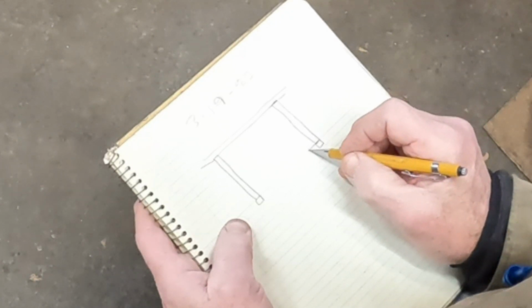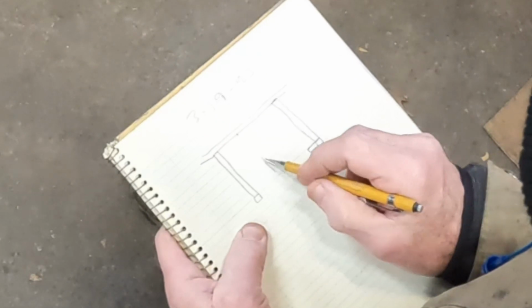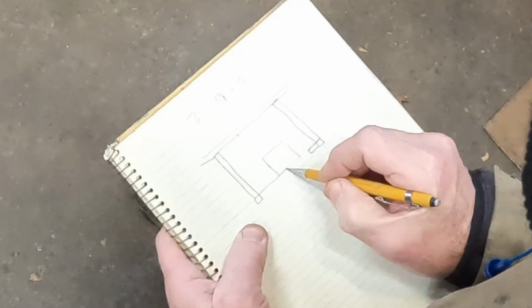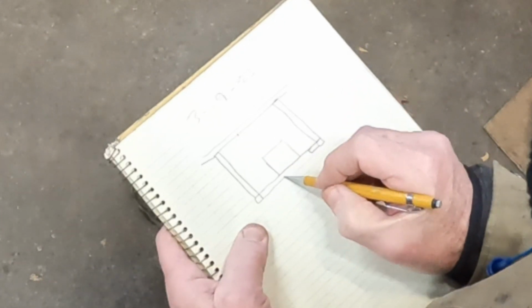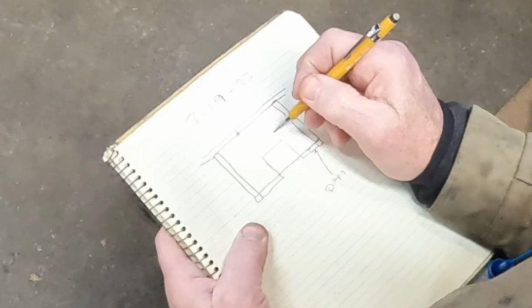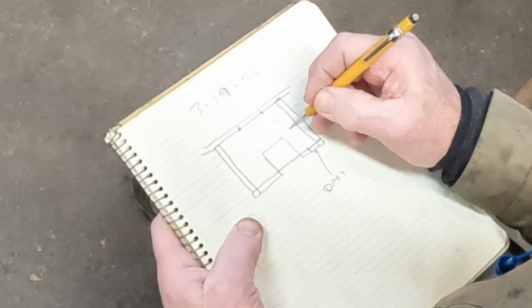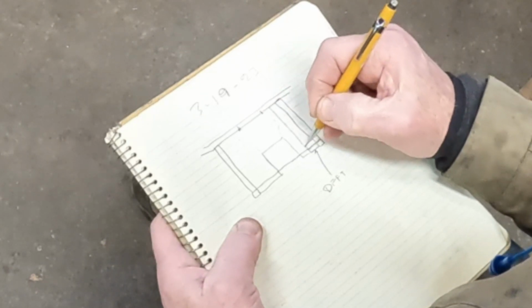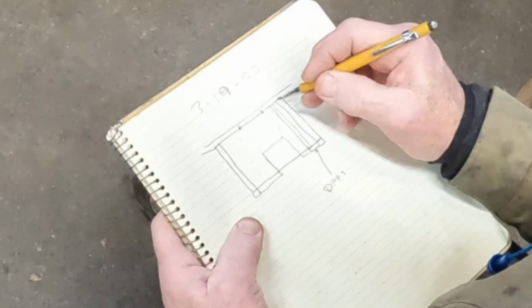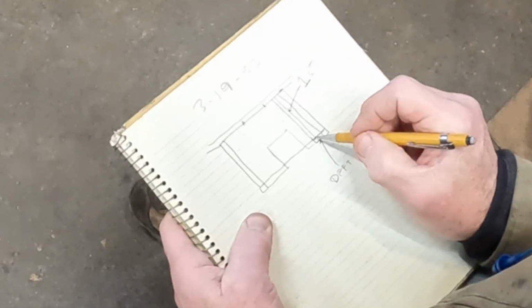Here is the driver's footwell fillet tube right here, which I have just capped, the drive shaft tunnel right there. There's the floor. There's that and that and that. And so we have marks right here for the width of the drive shaft tunnel. And what we're going to do is put in a vertical tube that goes like so, from the inside edge of the driver's footwell fillet tube vertically up to the firewall. That's our first thing we're going to do, is put in this vertical tube.